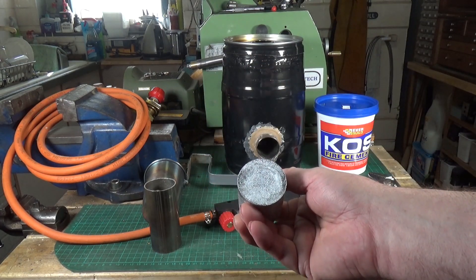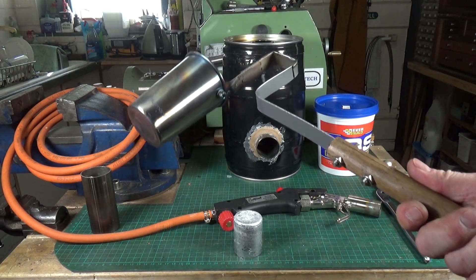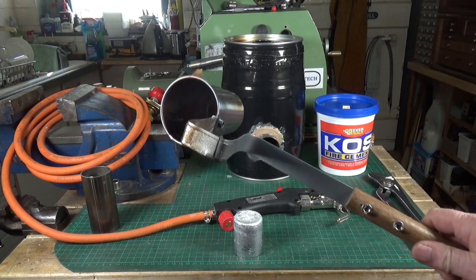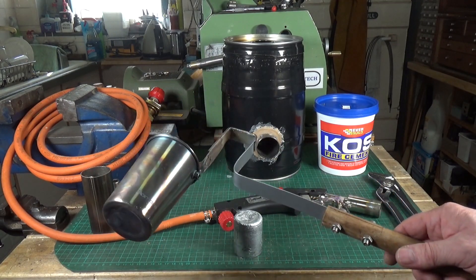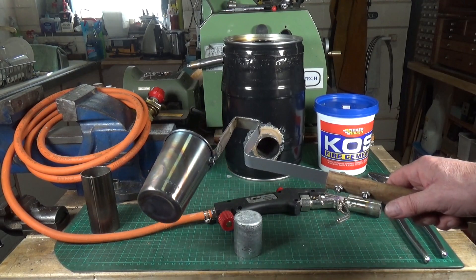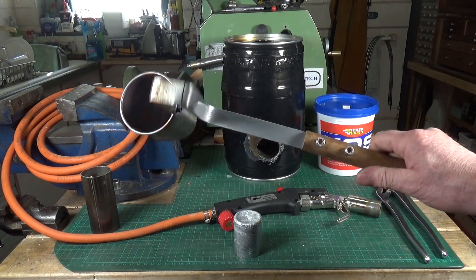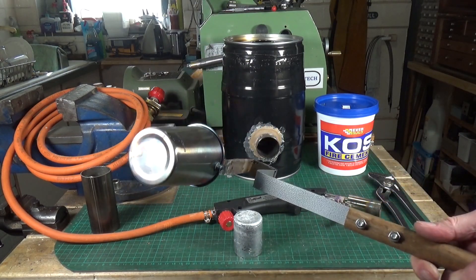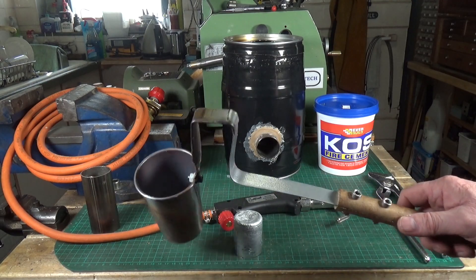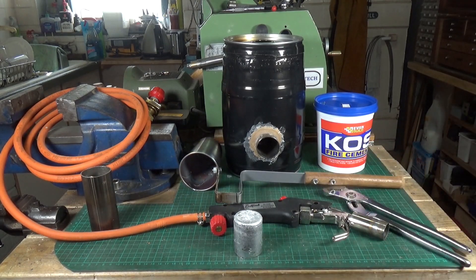I'm well pleased with that — it's come out really well. The ladle worked out quite well too; this handle doesn't get even remotely warm, so it's perfectly adequate. You've got to use protective gear when messing around with liquid molten metal — I used leather gauntlet things, a leather apron, and a full face shield when pouring. This stainless steel cup does the job perfectly. I'm not going to be doing huge quantities in this thing — that's about the limit — but it all works out really well.